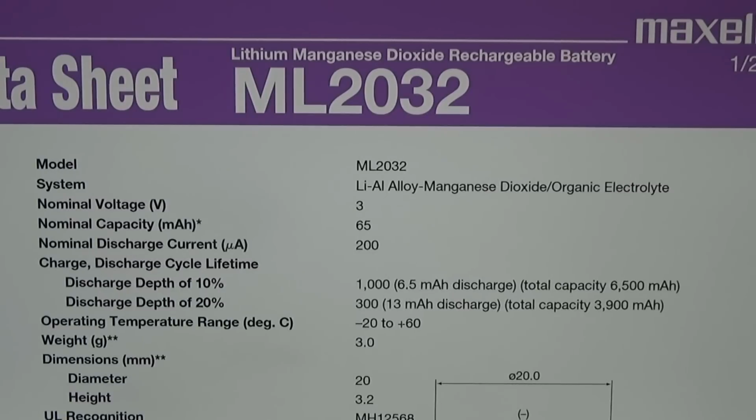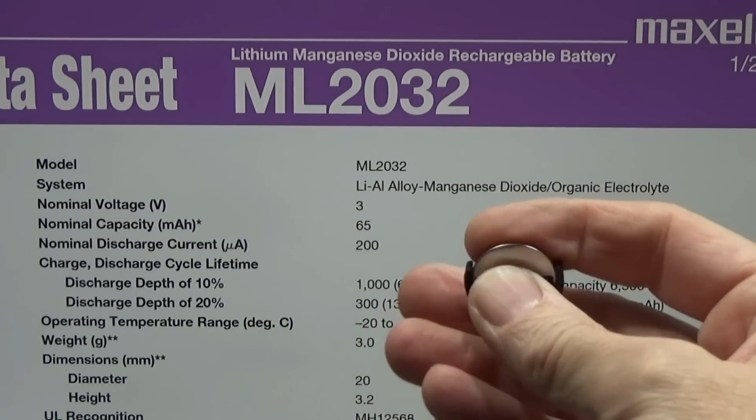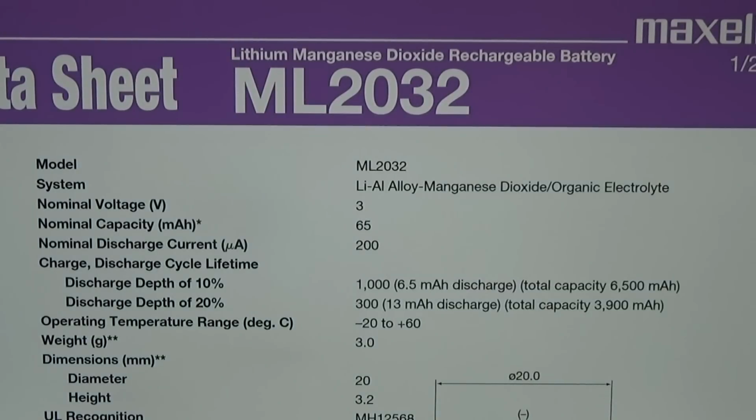Maybe we would have to adjust the charging current a little bit, so that is something we would then have to think over, but in general that is definitely a nice way to do it, because then you have a long time without needing to think about swapping out the battery when it is empty. So that is definitely another way to do it. These capacities are a little bit lower, but on the other hand, it gets charged, so it does not really need the 210 that we have seen from the CR type, right? That is something you can decide on your own.